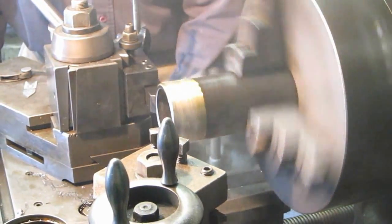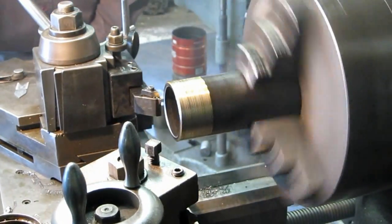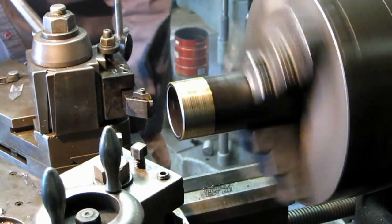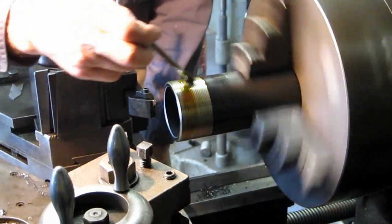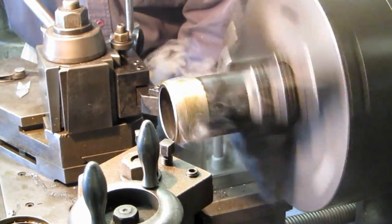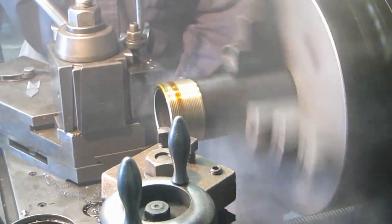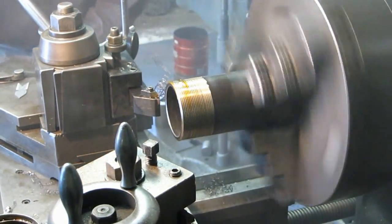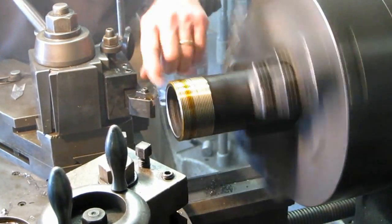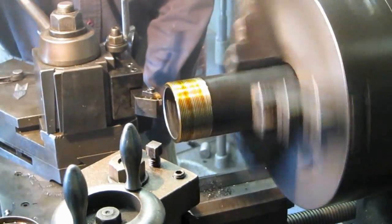This should only be about four or five passes across here, about ten thousandths at a time. When you're free spacing, you can always just roll it back to the next dial number and you're good to go. You also oil it while you're cutting — there's oil on there. In case you don't quite catch the next number on the dial, just go when you're comfortable.